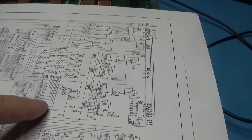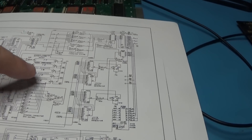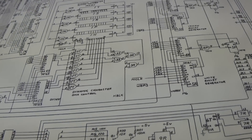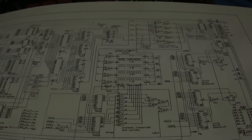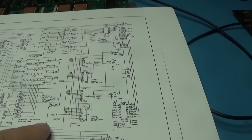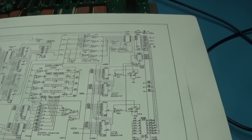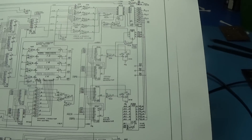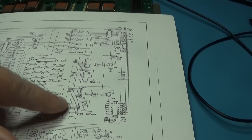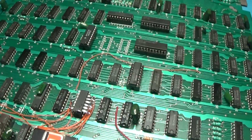So what is this? We have RAM addressing bits going in - the upper address bits of the RAM are being processed in with blank, to blank the data, to turn off data going in or something. The upper address bits are being processed to manipulate the data going into those RAMs somehow. We have an issue here with this 7432. First things first, let's get that thing replaced.